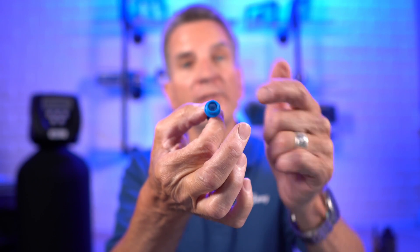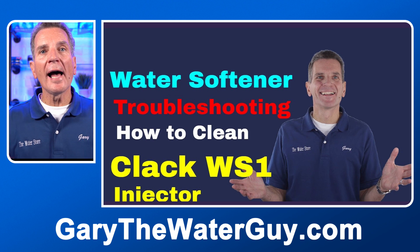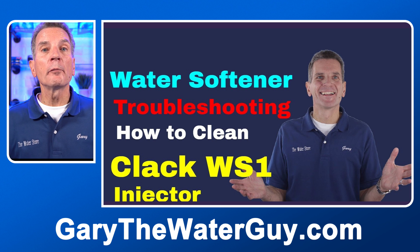The most likely reason you've got too much water in the brine tank is a clogged injector. On a Clack water softener, the injector has a very small hole in the middle — if that hole becomes clogged, it can't suck the brine out but it does keep adding more water to the brine tank. You need to either replace or clean out that clogged injector. I have a YouTube video showing how to access, clean, and replace the injector on a Clack WS1 valve — I'll put links in the description for the video and for replacement injectors. Also, manually go through a regeneration cycle to confirm the softener moves through every cycle correctly. If there's a problem with the circuit board it may skip a cycle, in which case I would replace that circuit board.